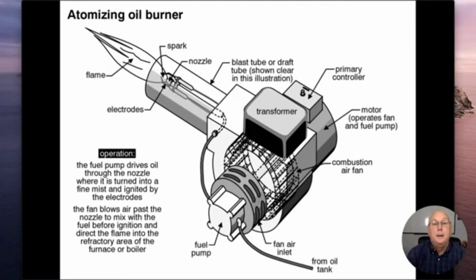If you put your hand on them, you might be able to feel them spinning, but you really shouldn't be hearing anything. If you do, obviously we're getting bad bearings or something's getting ready to go wrong. Maybe you can get by with just oiling it, but nonetheless, it's something that needs to be corrected, and they need to find out what it is. We shouldn't get any smoke coming off of these things. We shouldn't have any scorching, and we shouldn't have any soot being brought into the chambers or the heating units. They should be making a relatively clean burn, just like natural gas.